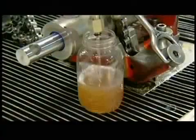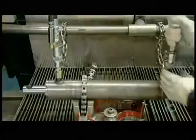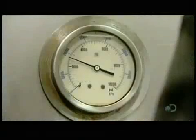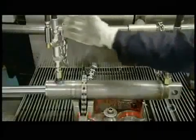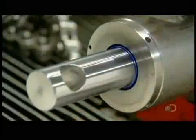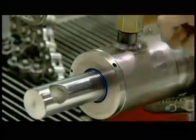This cylinder is now ready for fluid — hydraulic-grade oil specially formulated to operate under pressure. The technician attaches hoses to the cylinder to fill it with pressurized oil. As the pressure builds at one end, the piston rod extends. He then supplies fluid to the other end, and the rod retracts. He runs a finger around the fittings and sealers to check for leaks, and gives this hydraulic cylinder the all-clear.